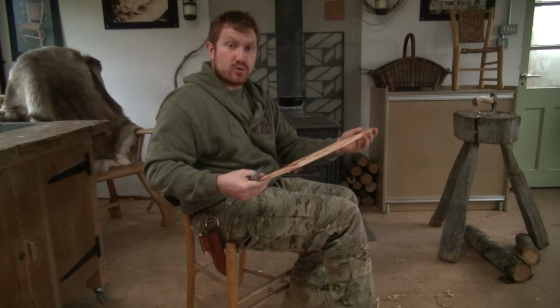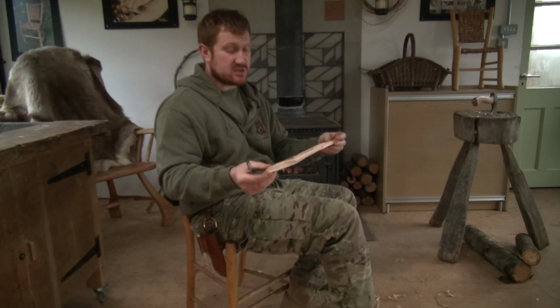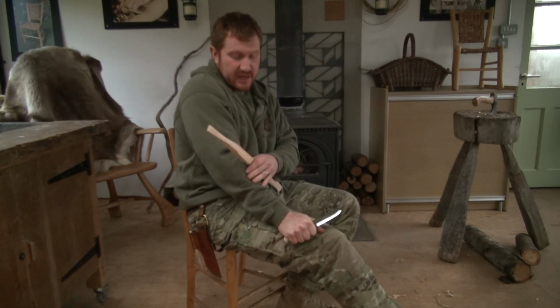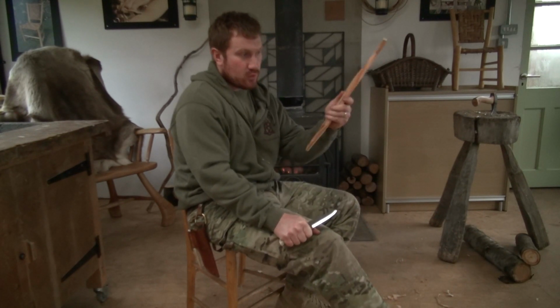So that was the finger push grasp. And the next one we want to show you is slightly unusual. It's called the gypsy grasp. Now this grasp actually means that we're going to hold the knife in a forehand grip, and we're going to effectively lock it onto our thigh by locking our arm straight. And the only thing that actually moves is the workpiece.